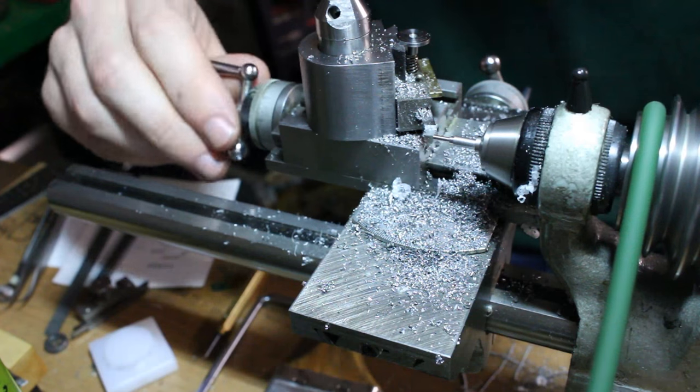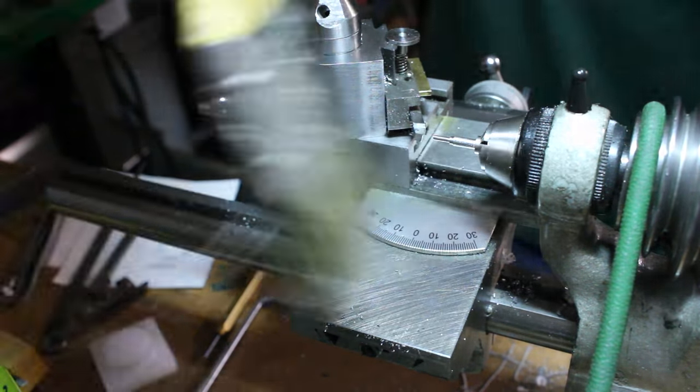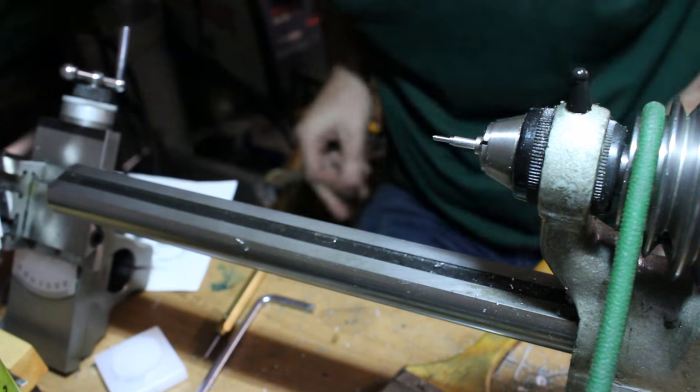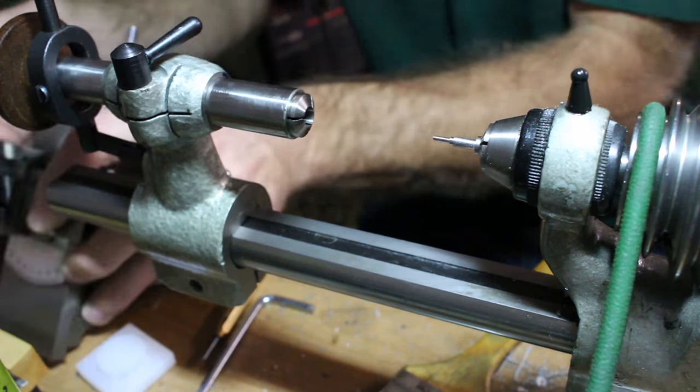Another minor difference is that the ends of these screws won't be domed. Instead, they'll have a little nub left for helping the screw to start. The nub is the same diameter as the root of the threads.